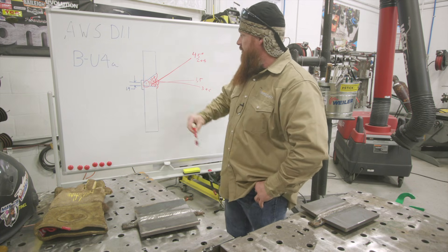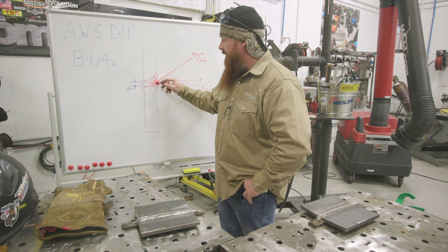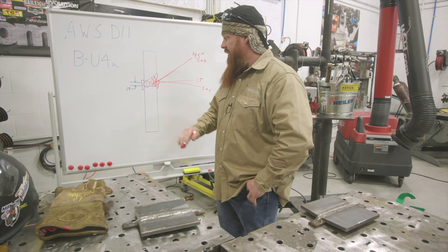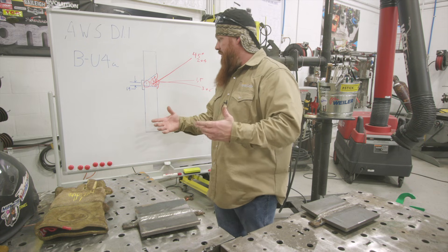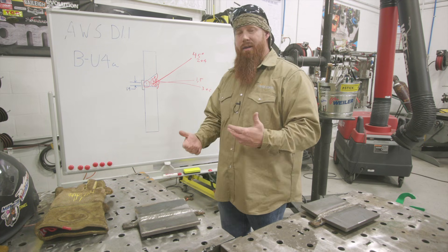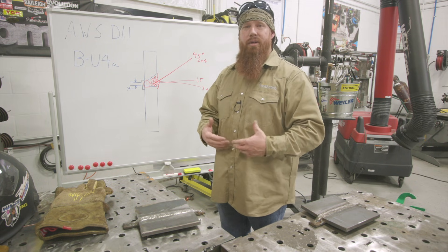At the end I'm going to pause and fill in that crater. So in hindsight I should have put one more inner pass in — tucked in a little bit tighter — rather than the two beads I put in there. A slightly thicker one would have pushed the elevation out just a little bit more. We ended up putting seven passes in. Still pretty close overall — it worked out in the end. You just have to be ready to make changes on the fly and adapt. Like that low spot at the beginning where I had to run a little two-inch bead to build it up — that's perfectly allowable. Things like that are going to happen.